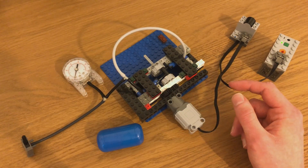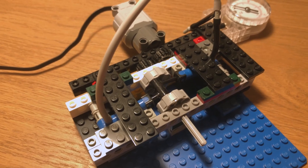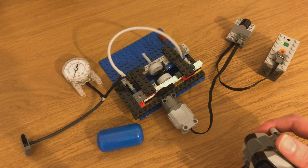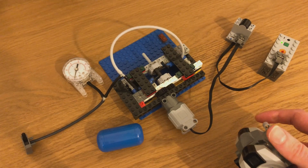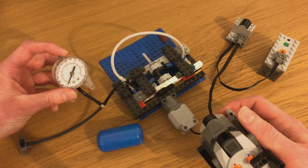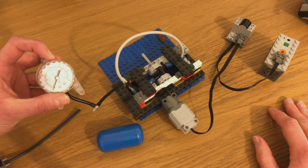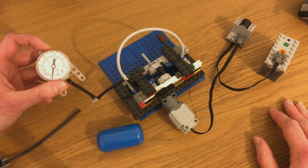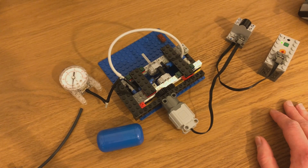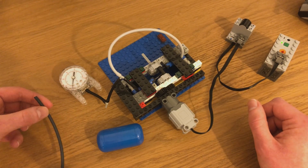For a crusher, we're basically just going to be compressing the air on demand, just enough to fill up the pistons to move the thing. I'm using the smaller style pumps that are actually designed by LEGO for use in compressors. You can see the pumps going at quite a nice speed, and closing this valve shows the rate at which it's building up pressure. It went up to about 40 PSI, or just under 3 bar, and at that point we've got hoses popping off — that's going to be a problem. I'm thinking I might have to make some sort of pressure relief valve, because I don't want this happening in a battle.